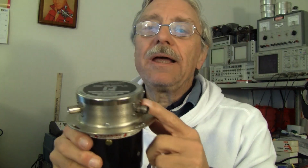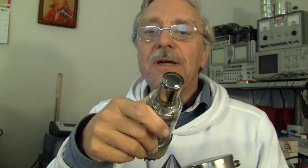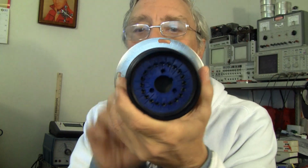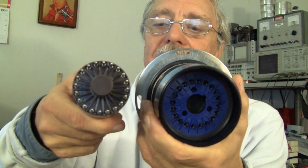So anyways, I got this nifty base. You supply it with 1000 volts DC, and it will output the video signal generated by the photomultiplier tube in the form of a microscopic current, which I know how to deal with photomultiplier tubes. You can see this tube has a lot of pins. It has a lot of multipliers. I believe there's 11 multipliers in here.